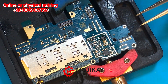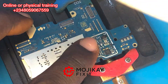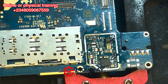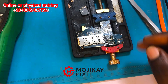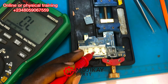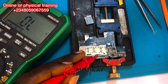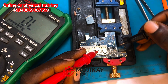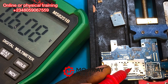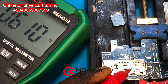I have removed the capacitor — this is how to do proper step-by-step troubleshooting. Let me cool down the PCB, then we are going to take another reading with the multimeter on diode mode. We'll test where we removed that capacitor — the capacitor has both positive and negative parts — and let's see if it's still shorted to ground or not.